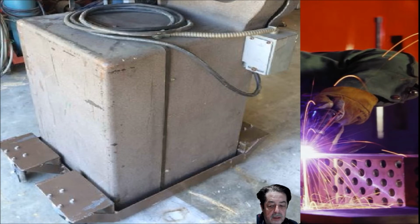They're called gussets. You'll hear people in videos a lot of times talk about gussets. They're talking about these additional diagonal support pieces. Now let's go back to the ones in the front, and on the inside you see he's got gussets too. And this is probably a good 1/8 inch thick plate steel that he's used to make these 4 bases, let's call them, for the wheels that he's attached. Very simply, he then attached wheels. You can see where the 4 bolt holes are, and he created this platform.